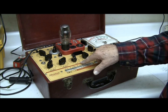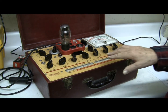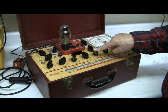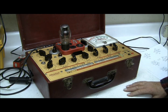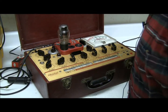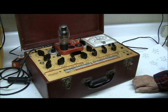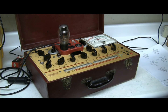There is no grid in that rectifier tube as you saw — just one cathode and two plates, so you don't have to worry about that. But we have to set the plate voltage, and that plate voltage is like 250 volts right now. There is no screen — we'll talk about those later. The cathode is at ground, at zero. The suppressor is not used here. The bias setting is set at zero because there is no bias given in a rectifier tube.